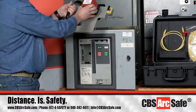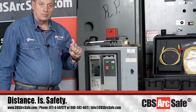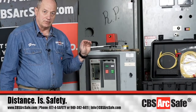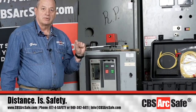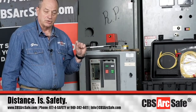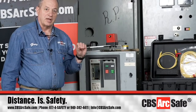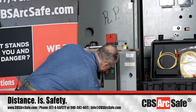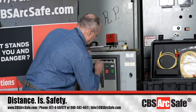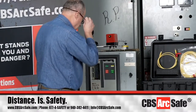First, I do have to charge it. One thing to mention about the charging operations on the Magnum DS breakers: the normal number that we see for 99% of the breakers is five strokes on the handle. However, the Eaton literature says it may take between five and seven strokes to actually charge a Magnum DS breaker. So you may find some variance in your switchgear from the five that we see as the predominant number. We've now got our charge indication on the spring, and now we're going to place the RSK on the front of the breaker.